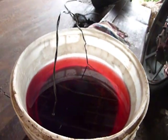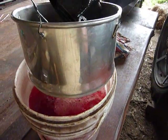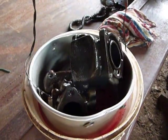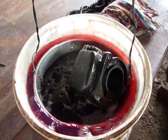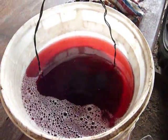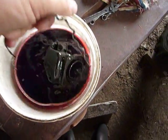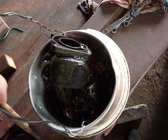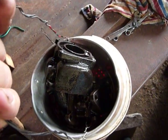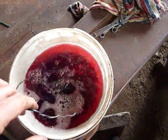Right here, this is my handy dandy homemade parts washer. You can see it's kind of hard to see — everything's kind of wet and dark in there. That's my carburetor. I've got it soaking in some diesel fuel right now, and then I'll take it out. The major castings are cast iron and they've got a little bit of rust in them, so I think I'll probably put them through the electrolysis tank and get them cleaned up, and put the rest through some carb cleaner. That shouldn't take too long.